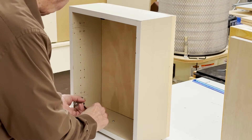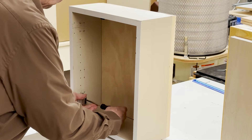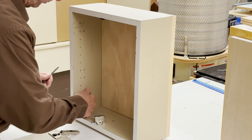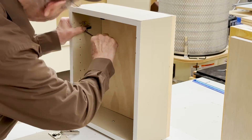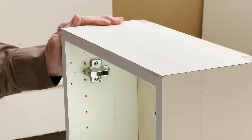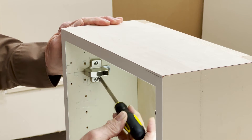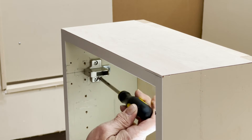The plates have to go back — instead of 37mm, we've got to go the thickness of the door. So it's 37mm plus door thickness. You can just barely see the screw hole back here. And then under the plate here, you can see there's an adjustment screw for up and down — a cam adjustable screw — right there. That's for up and down.